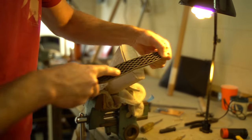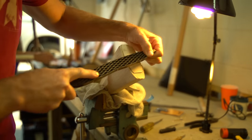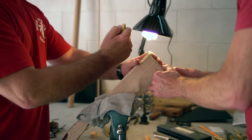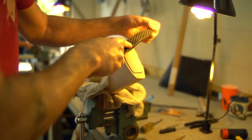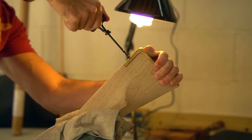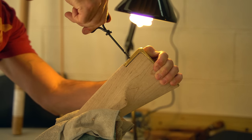Next was shaping the butt of the stock so the brass butt plate would actually fit on there — slow going, removing material and continuing to work it. Thinking I was in the right spot, I ended up drilling a hole for the butt plate — not in the right spot. The fix: drill a bigger hole, glue a piece of dowel in there, and then drill the hole where it should have been the first time. Pretty clever fix. Having learned my lesson, I went a little bit slower this time, initially using a hand drill.